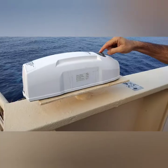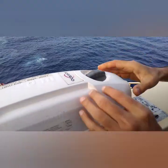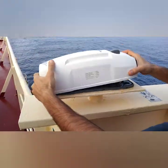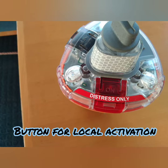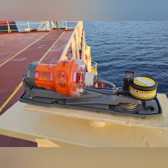So something so important has certain performance standards — let's go through them. This is how the EPIRB is installed on board a ship; it is mostly on the bridge wings or on the monkey island. The basic idea is that if the ship sinks, the radio beacon will get clear from the ship. One of the operation standards is that it should have local manual activation; remote activation may also be possible from the navigation bridge, and the device should be installed in the float-free mounting.